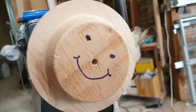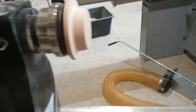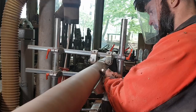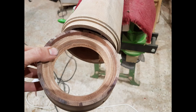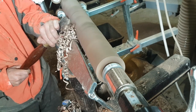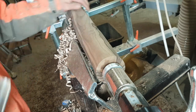Any big lathe will be an incredible addition for those who make straight didgeridoos. This one is made by Magma — it's from their Black Series, the model is Titan 400. It is a perfect tool for making even wall thicknesses and it is quite fast in doing so. It's also great for attaching bells and mouthpieces with a slot, which creates a very sturdy joint. It takes some practice, and with long pieces you always need a steady rest, but having a big stable lathe really allows you to work with confidence and have great results. They're expensive, but they're so worth it.